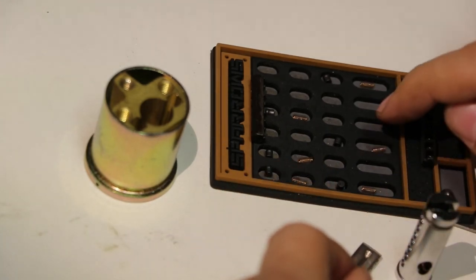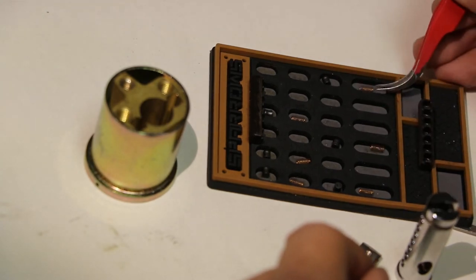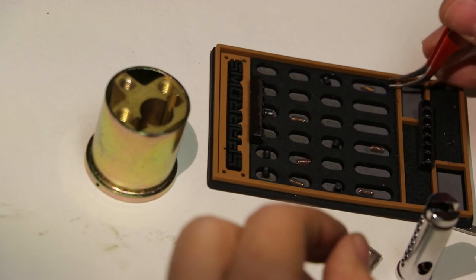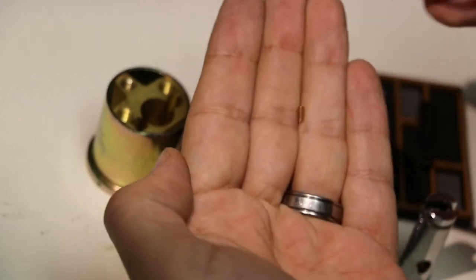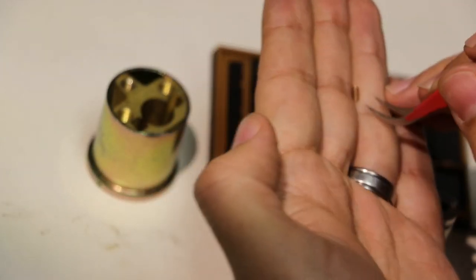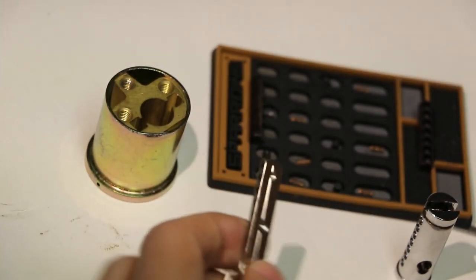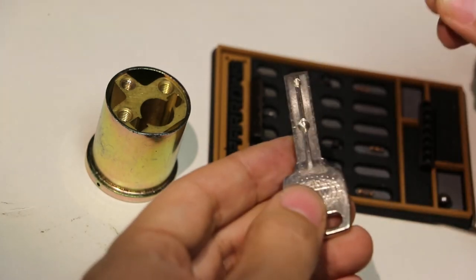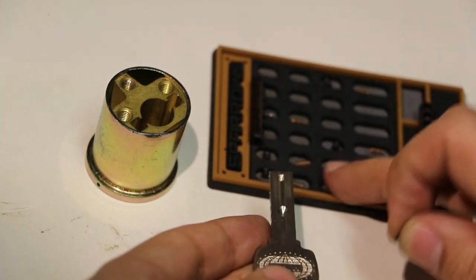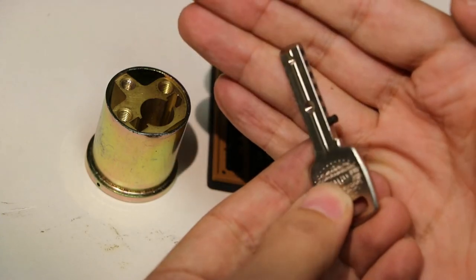These springs are super, super lightweight, like almost no spring force. So it's really easy to recover from a bricking, which, like I said, I'll show in another video. But there are these tiny little springs. And if you want to rekey it, you notice how I took it all out and I don't care. As long as I know this is the right side pin one, I'll take it and I'll align it to the key on pin one like that.